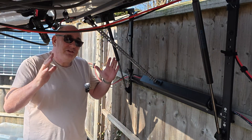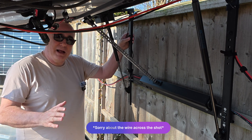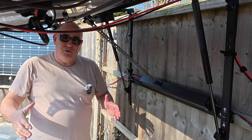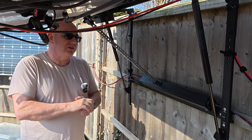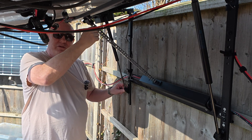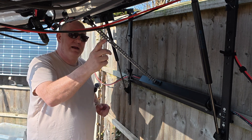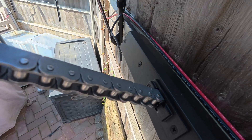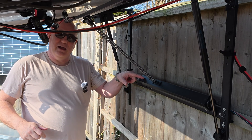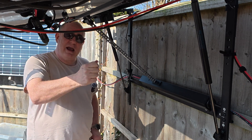Now let's take a look underneath the panel. The system is really simple. We have a frame with a hinge at the top that hooks over the back of the fence, just like any standard fence or balcony mount for a solar panel. The system uses two gas struts — exactly the same as the ones in the boot of your car if you've got an automatic opening tailgate. These in the normal position are fully extended, so they want to push the panel upwards. In the middle there's a chain — as it unravels it locks into place as a straight rod which pushes the panel away. To move the panel, a motor cranks this chain in or out: pulling it back in lowers the panel, letting it out allows the panel to go back up again.